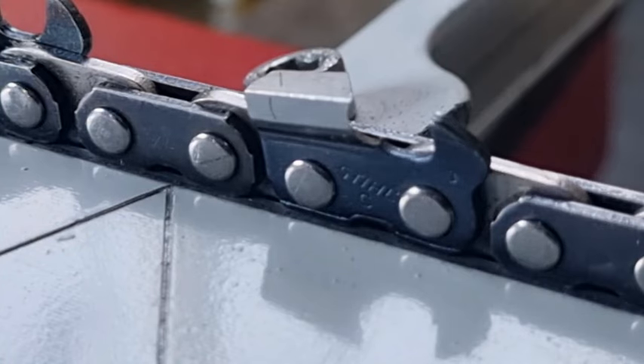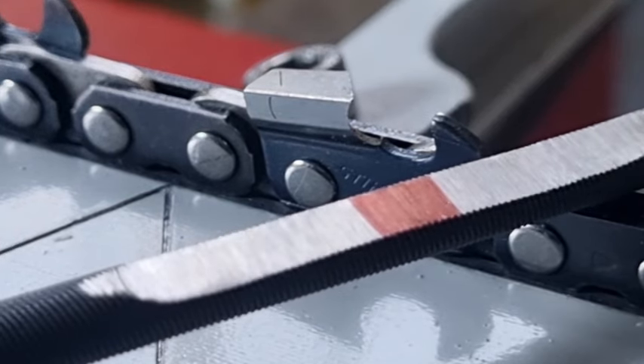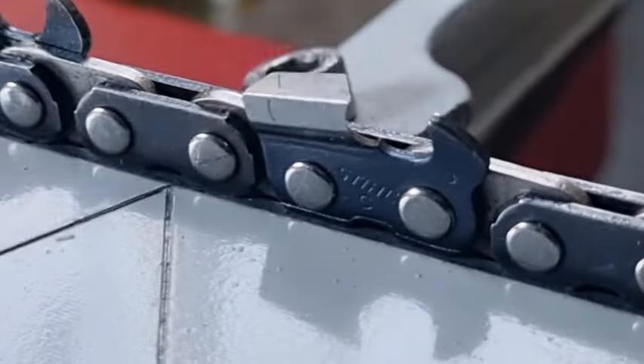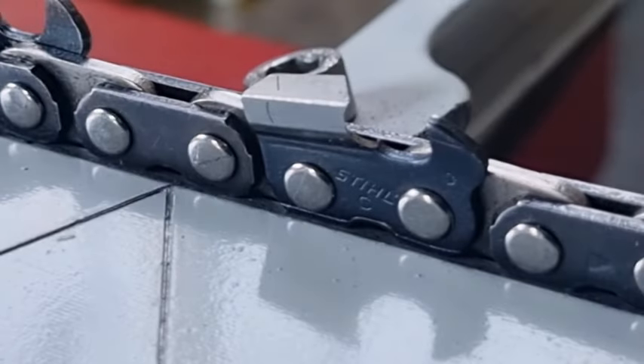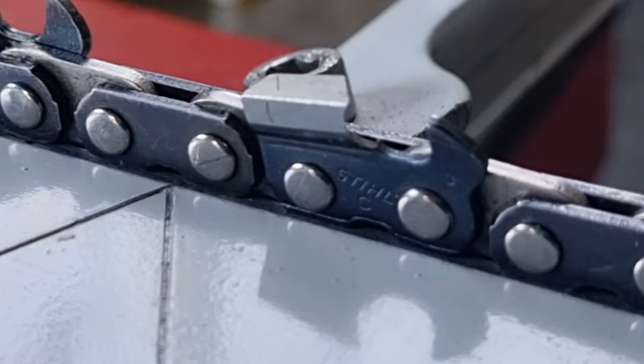It's not a bad little tool just for checking purposes, making sure you're on the right track. If you do the left hand and right hand using this gauge — this is a 5.5 millimeter file on a brand new tooth. I prefer to use a 5.5 millimeter file, and when the tooth wears halfway down you swap over to a 5.2. You can make them yourselves, because anyone who does a lot of hand filing will have spare files. All I did was use the edge of a bench grinder and ground it down nice and slow, measured it with a vernier until I got the right height. It's a great system for FG2, FG3, Granberg, or any other brand — instead of guessing 20 or 25, you can custom make that height to whatever you want. Thanks for watching, bye for now.